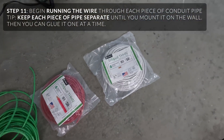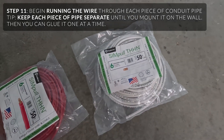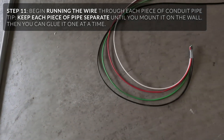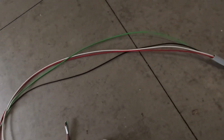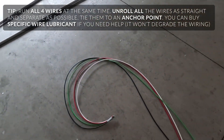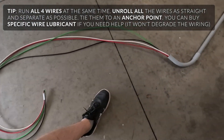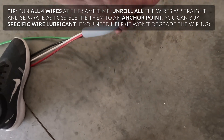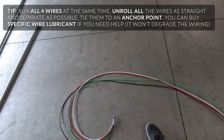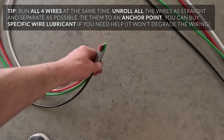Here are my four wires — 50-foot THHN, which is stranded: white, red, green, and black. I taped the end, unraveled them, and walked them out all the way through the entire house. It helps to have someone on the other end holding tension to keep them separate, but this is the best method. Unroll all of them first, then thread through and slowly make your way to the end. Put about three to four excess feet in the box, so account for that too.